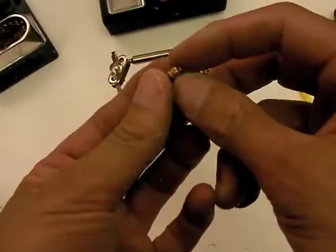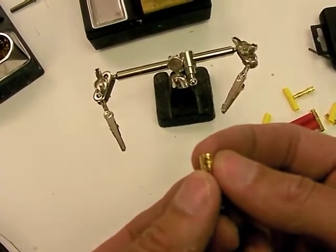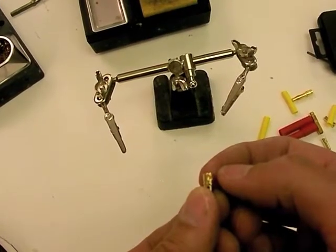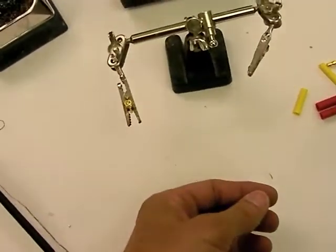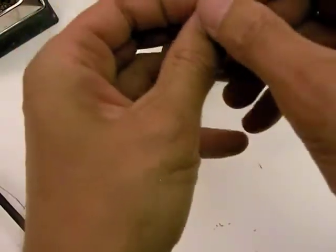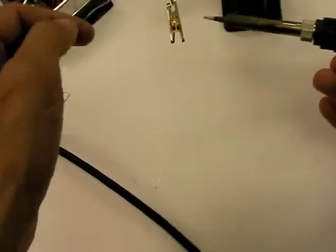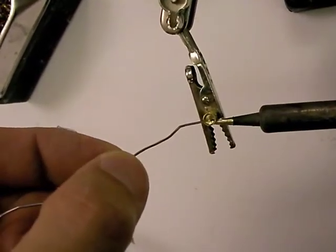The way we tin the connectors from the speed controller to the motor is: notice there's a little hole here. I'm going to stick the end of the soldering iron in there and just fill this thing with a pool of solder, then dunk the already-tinned end in there. I'm going to put the little holes off to the right, where my hand's going to be. I'll set up two of these at a time to save a bit of time. Pick up the soldering iron, clean it up — it's a nice fine tip, which helps get the dunk right. You might want to wear safety glasses when you do this, because people who do a lot of soldering can flick solder into their eye, and that sounds really painful. Definitely consider safety glasses.